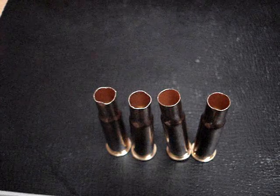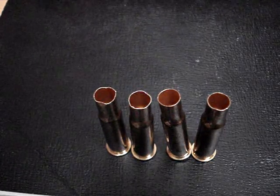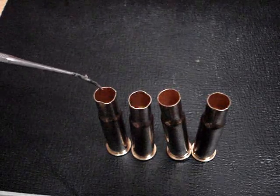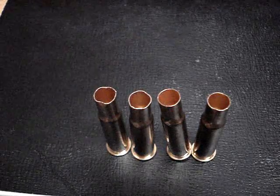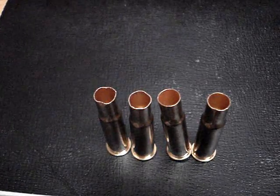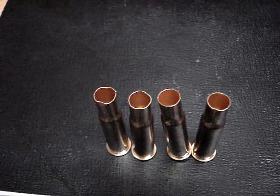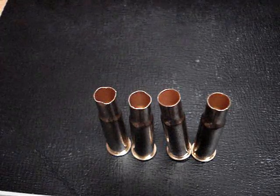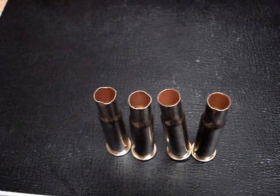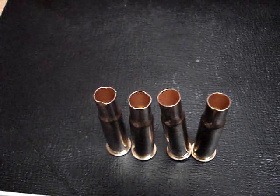Here are four examples — I just pulled these out of the box, just grabbed four and went with it. These four pieces of brass are brand new and unfired. Look at this guy here — this guy is a mess. This is the reason why, and there is a big misconception that new unfired brass is perfect. It is not. This stuff comes out of the box in all different kinds of conditions: dents, shoulders aren't fully formed. You want to run it through your full-length sizer, trim it, and fire-form it.